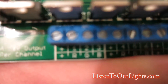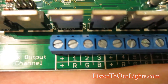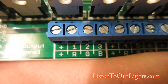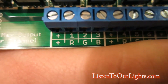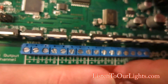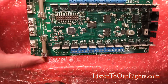So you can see one, two, three — RGB — that would be one strobe or one floodlight. That plus is the power. If you look at the dongles that come off the 10-watt floods, there's four, but you could also hook up dumb strips and so on. That's the case for each one of these. There are 24 ports and it supports eight RGB channels, which each take three ports.